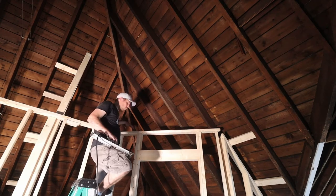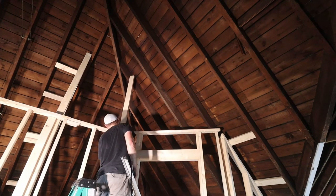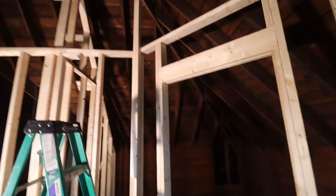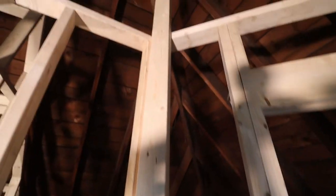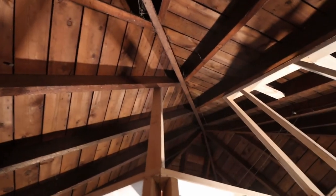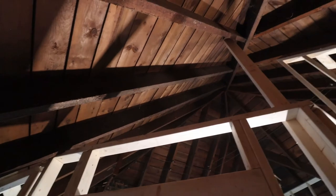What I'm going to do is just run a board in the corner of both sides all the way up. Then I'm going to measure the distance in between, cut the board, and see if I can fit it this way. I basically just attached a stud temporarily all the way in the corner of this wall going right up all the way up to the ceiling. Now I know the inside of this stud is where the corner of the wall needs to be. So now I need to do the same thing over here — put a line in between, measure it, and then start cutting the board to the right length and figuring out the angles that the ends need to be on.